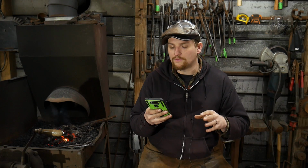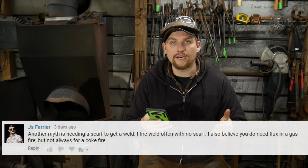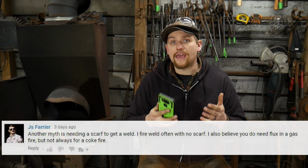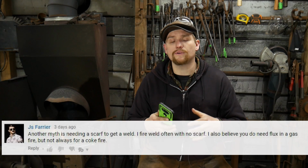Another question, it wasn't really a question, it was more of a comment that I would like to address in this Q&A. This one was by J.S. Ferrier. Another myth is needing a scarf to get a weld. I fire weld often with no scarf. I also believe you do need flux in a gas fire, but not always for a coke fire. So in a gas forge fire, the environment is different. I have been able to weld successfully without any flux whatsoever.